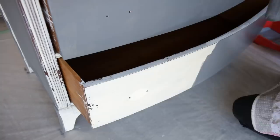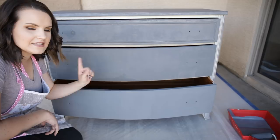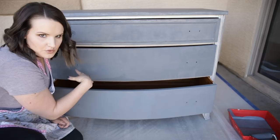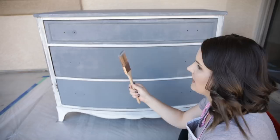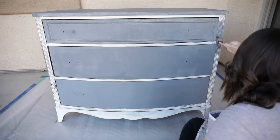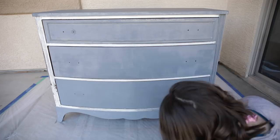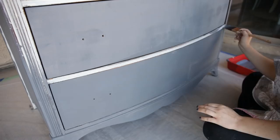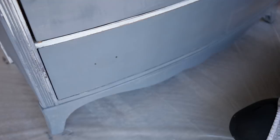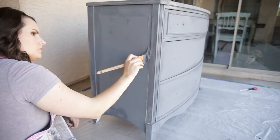I've now painted the first coat on the entire dresser except for some of the detailed areas. I'm going to push my drawers back in and paint some of the areas in between the drawers. For this I'm going to use my paintbrush, loaded very lightly with paint so that it doesn't drip inside the drawers — almost like dry brushing, but not quite. I still have a flat area on the dresser so I'm going to quickly go in with my roller on that area since it's really simple.